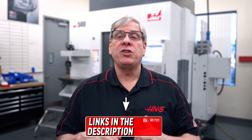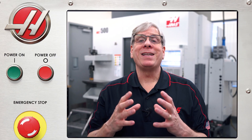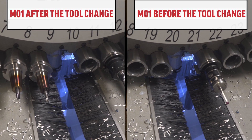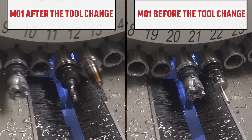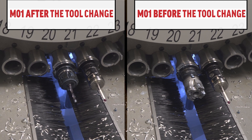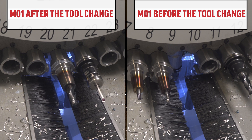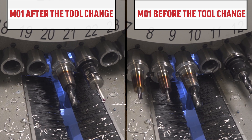Let's briefly review the M-codes I'm referring to — there'll be links to each of the videos in the description below. First was M1 optional stop. This code by itself doesn't slow program execution, but it does affect the look-ahead function, so the control will not pre-position the tool carousel on machines with side mount tool changers. Pre-call the next tool with a T-code, delete the M1 entirely, or move the M1 after the next tool change to speed up all tool changes by pre-positioning the carousel to the next tool.